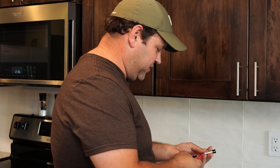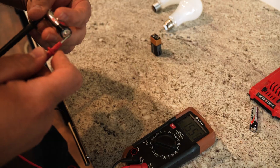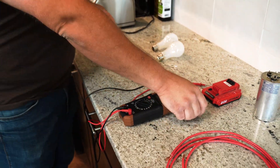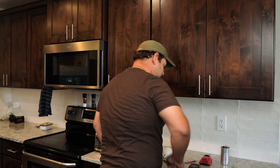These ones should be one and a half volts. I'll switch this to the 1.5-volt setting. And look at that — 1.56, 1.58. That's good, which makes sense because it's a brand new battery. And Energizer, I would expect you to give me at least one and a half volts. All right, test number one done.